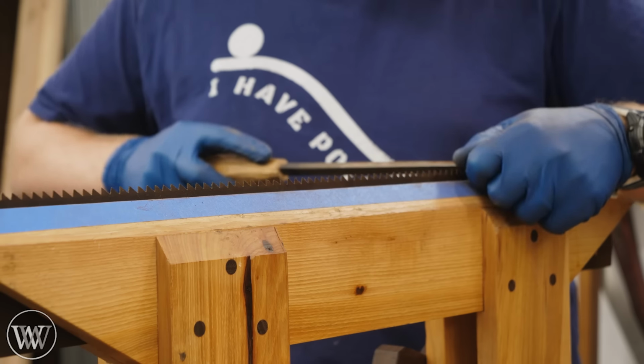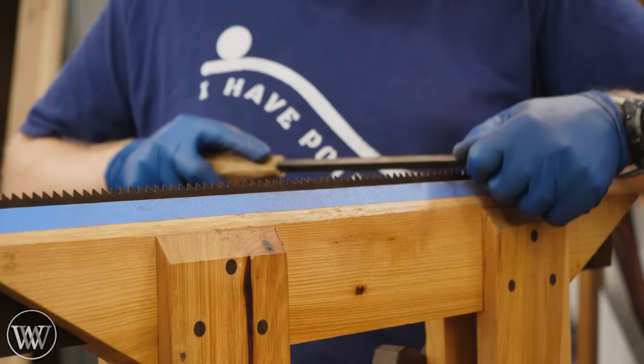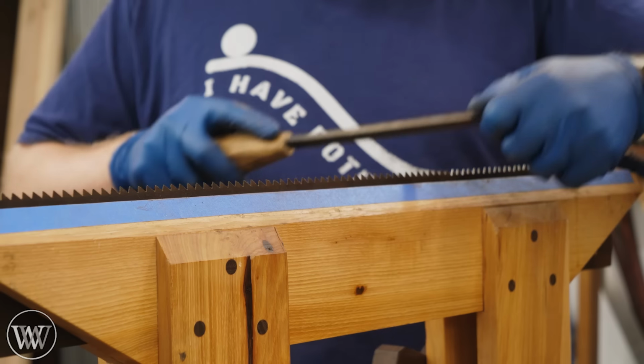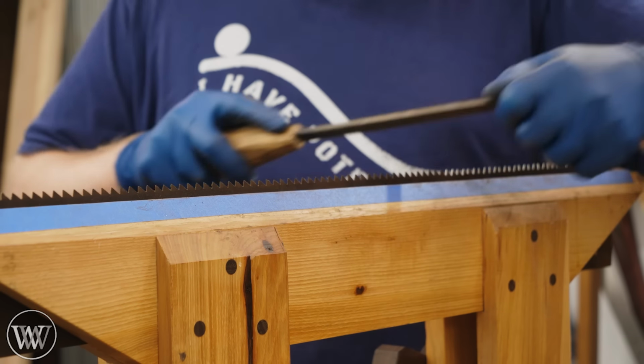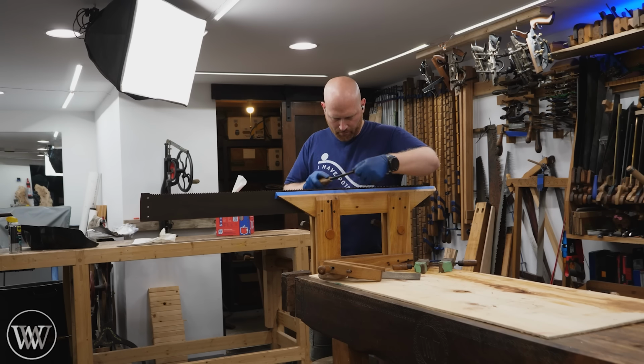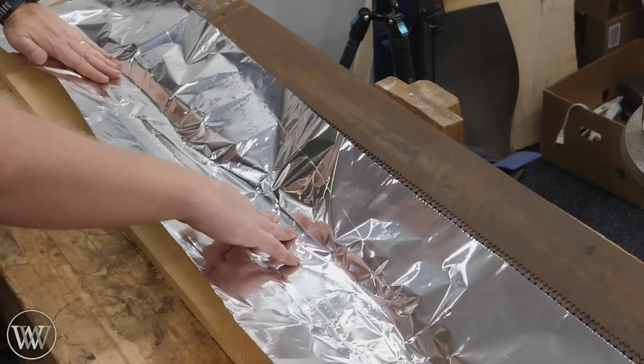For the crosscut, they're nice big crosscut teeth, and I had to find the largest triangular file I had. But for the rip cut, these are actually relatively small. They're about 4 point per inch, which is actually kind of small for that big of a saw. But we'll go with what we've got and see how it goes. Unfortunately, one tooth broke. Just one tooth, which is actually pretty good for that.